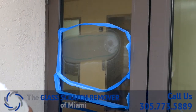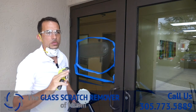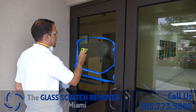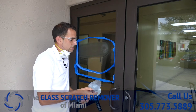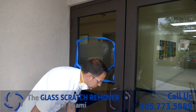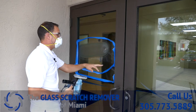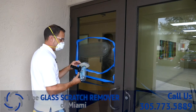I'm going to dust that off and check it now with the temperature. Remember, you want to keep that temperature between 120 and 150, keep it closer to the 120 mark. Right now we're only hitting about 100 to 108 on this side, so it's not too bad. We'll keep going, flip the mesh over and get the other side that's new. Put the mask back on. I've already taped it off — that tape helps reduce a little bit of the dust that's flying around, keeps it in a nice space.